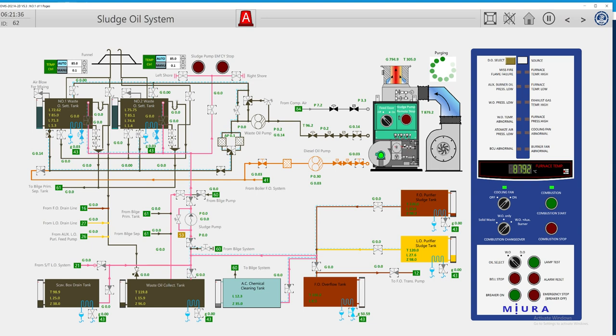For the moment I will stop the auxiliary burner to see if waste oil alone can handle it. I will open the return back to see — we will have suction from here and send it all the way there. If there is any recirculation it will go back to the tank again. The temperature really drops — let's put it back again.